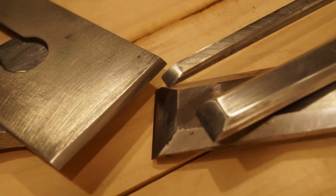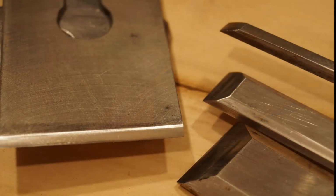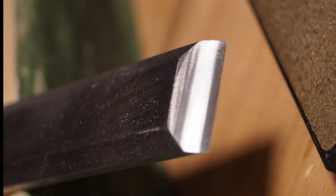When using a chisel, be sure to securely fix the workpiece in a vise or clamp, and under no circumstances should your hands or other body parts be in front of the cutting edge. Good sharpening is necessary. To cut a groove, clamp the workpiece in a vise, take the handle, sharpening bevel down, in one hand and strike with a mallet in the other hand, removing the bulk of the waste. Turn the workpiece over and repeat the work on the other side, gradually leveling the hole being made. Then turn the chisel over with the sharpening bevel up and, holding it between your thumb and fingers, manually cut off the remaining excess material and level the bottom of the hole.